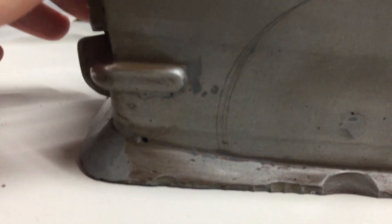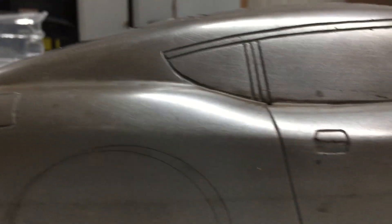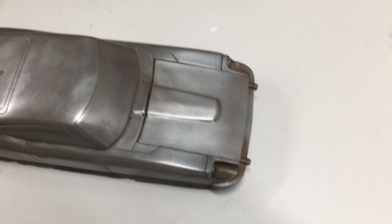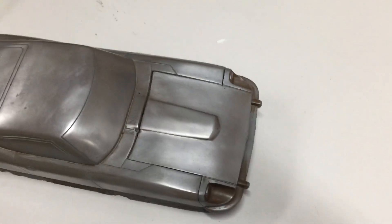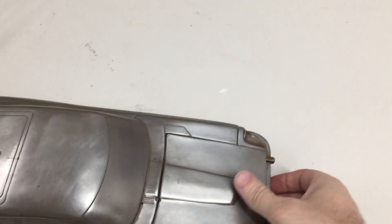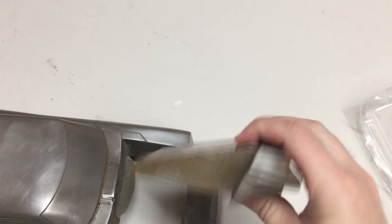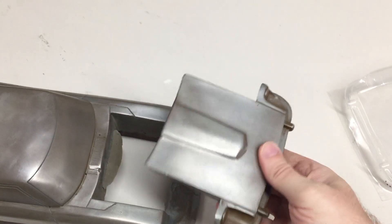You can see we did some fill in certain spots — there's some big fill in here, there were some dents in there. Lots of little air bubbles in the original casting. But what you really want to know is how do you get that undercut? So I'm getting that undercut because this is a two-part mold — look at that — that's how you get that and are able to get the body off the mold.